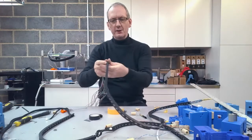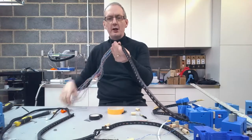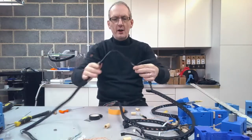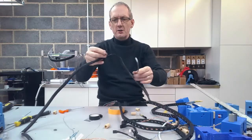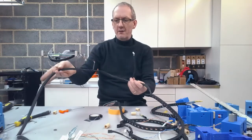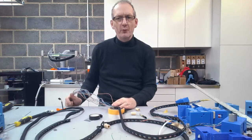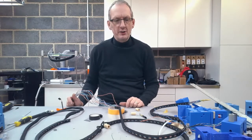From here onwards, this now goes all the way down to the board. So essentially what you can do is what I've done on this one, I've just got some braiding and I've just put the braiding on. Ignore these two wires now which I've got in here, because we won't be utilising these wires off on the main harness. This one will just continue all the way down, so you can braid that all the way down, ready to go onto the board itself. Okay, so that'll be in the next videos as we continue through the build.